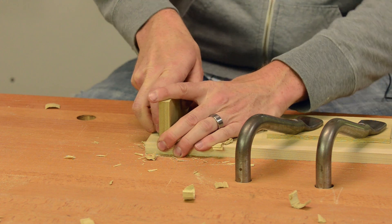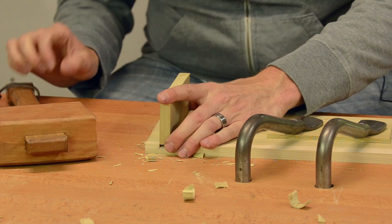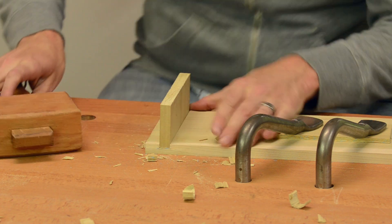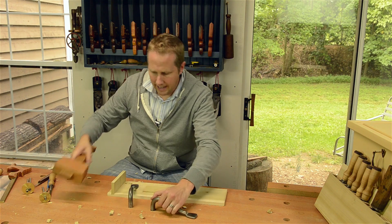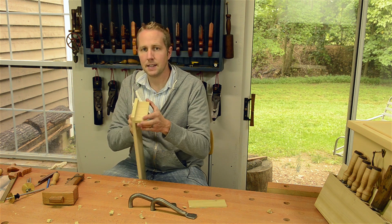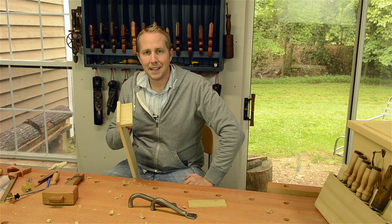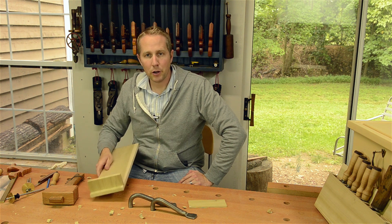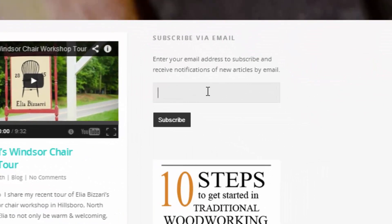Now let's see if it fits — cross my fingers. I should have marked which way this goes, just to make sure it fits. There you go — that was the right way. If you forget to mark it, you'll figure it out. And there you go — a very tight and custom-fit dado joint. You can see how it works: imagine this is a little wider and this is a shelf — it gives you a nice strong joint. That's the easiest way I know to make a dado joint. Don't forget to subscribe up there on the blue button, and remember to subscribe to my traditional woodworking blog posts at woodandshop.com.